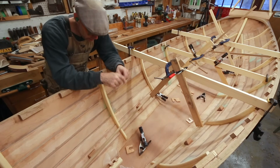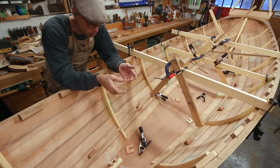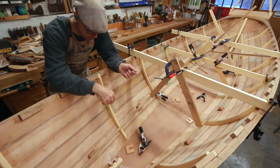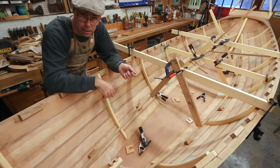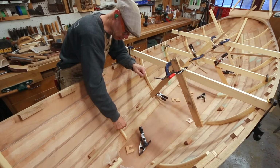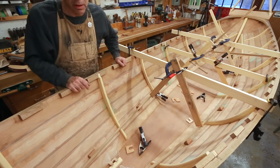The way I like to do stuff like this is I like to do my first hole that is the core diameter of the screw. And then I'd follow up with my clearance holes and my countersinking and all that. Now we're doing a counterbore, and for that I use a Forstner bit, and so I need a smaller pilot hole than normal. So I think I'm just going to do, I don't know, a 3/32 pilot hole or something like that, something that's much smaller, that the lead spur on the Forstner bit can follow more easily. So that's my plan there. So let me get that set up and we'll start drilling.